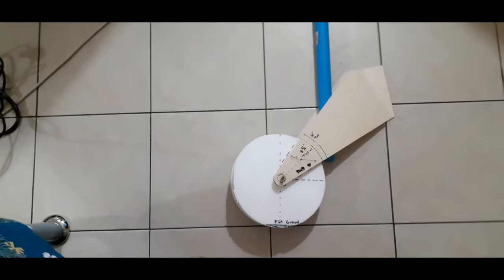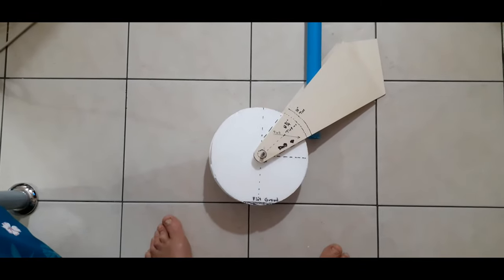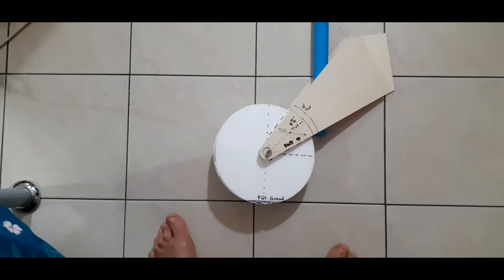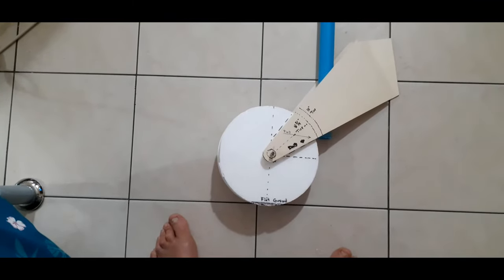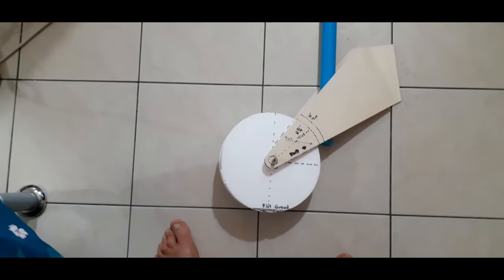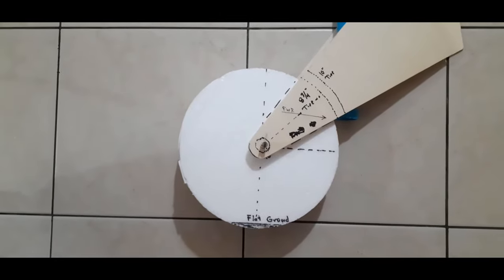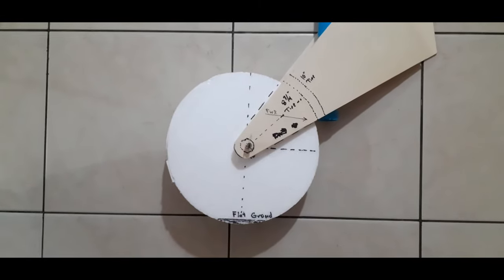Okay, so here's the design layout for my nose wheel. I'm converting my powered paraglider to a trike, a powered paragliding trike. One of the things with wheels on aircraft is you want the nose wheel to be able to self-steer to some degree, so it'll tend to correct in the direction of the wing. If the wing's falling off to the right, you want the paramotor to have a tendency to correct that and go to the right as opposed to swinging you the wrong way. So it's a stability issue on landing and takeoffs, but landing's more of an issue.